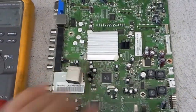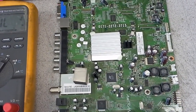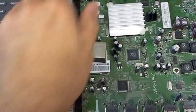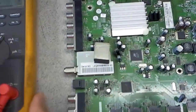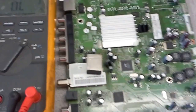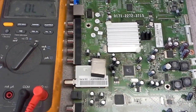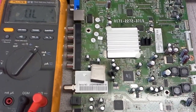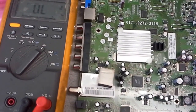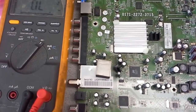We don't offer a repair service for that board as of yet. There are two problems that we have seen develop with it that we are so far unsuccessful addressing. However, there is a third problem that we have seen that is not so difficult to resolve. The symptom for it is that you don't get HDMI out of the TV, and in some cases it may be even worse — the board may not be coming up — but it's usually just that you don't get HDMI.